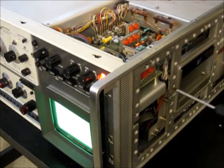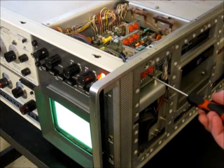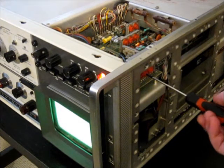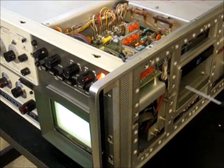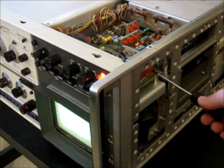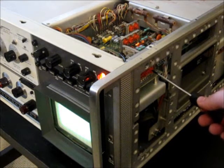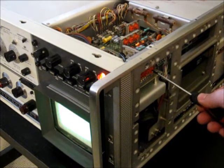The next adjustment is the middle of these three — the collimation for the flood guns — and turn it until you can see the pattern from the flood guns on the front of the unit: two overlapping rectangles one on top of the other. Then go to the third adjustment and adjust it so you get a pretty even illumination pattern between the two units. This may not show up on camera clearly.